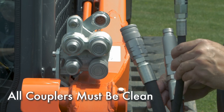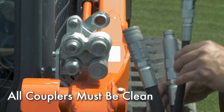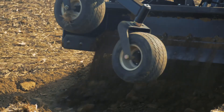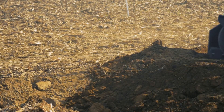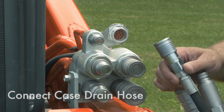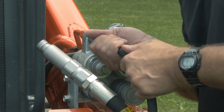Connecting the PD series grader to the Kubota loader's hydraulics is straightforward. Make sure all couplers, both on the grading box hoses and on the loader, are wiped clean and dirt free. Dirt is the leading cause of hydraulic failure and can easily enter a system through the coupler connection process. Connect the case drain hose first — this is something ATI Corporation added in 2019.